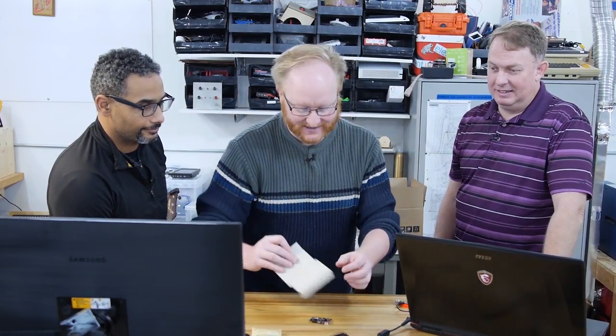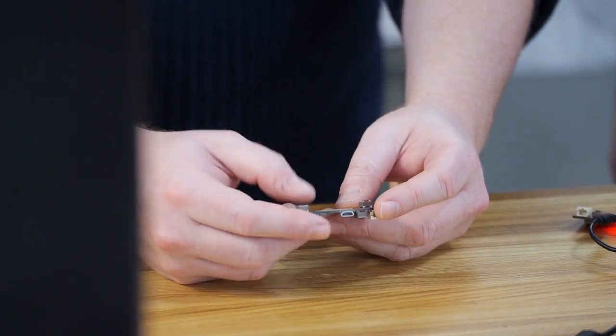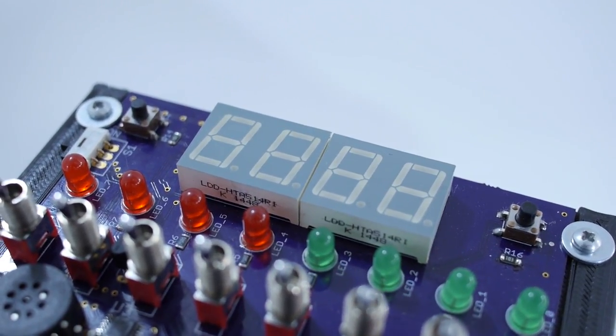You could plug it into the top or back with a window so the micro:bit display is visible, and have the digits below. The connector — the coplanar version is through-hole and there is a surface mount vertical version. With the connector I was looking at, it's still human-solderable. Someone could solder everything else while keeping the components larger. We could even remove some of the surface mount, though you should learn how to surface-mount solder — maybe passives and larger ICs.